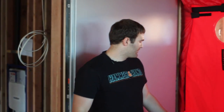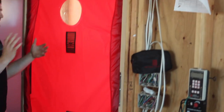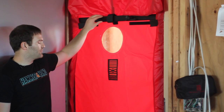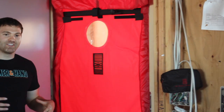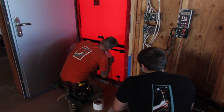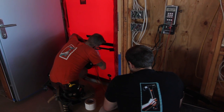Because the building is a little tighter, it's really sensitive if people go through a door during the test — it'll cause a lot of pressure on the door frame. So we used two of these cross braces to help keep it in place, and we make sure we're really careful about getting the seal here, because when you get into these low leakage rates that a passive house has, you can lose considerable leakage around the door and also around the shroud of the fan. The door is never going to be perfect, but we do our best to keep it tight.